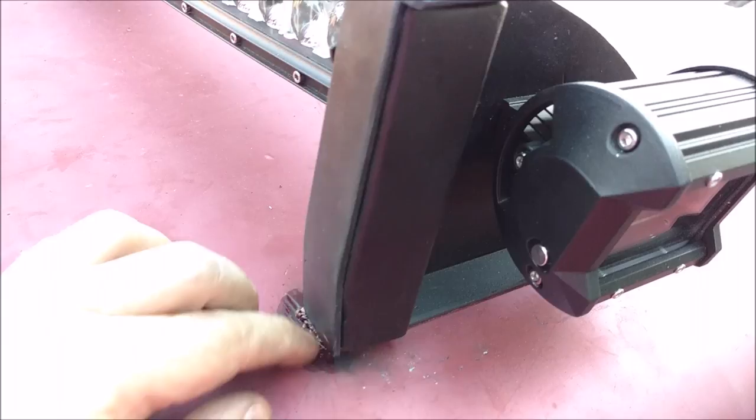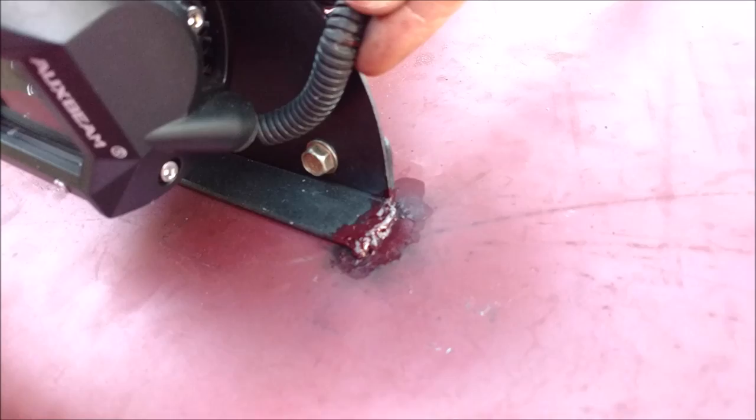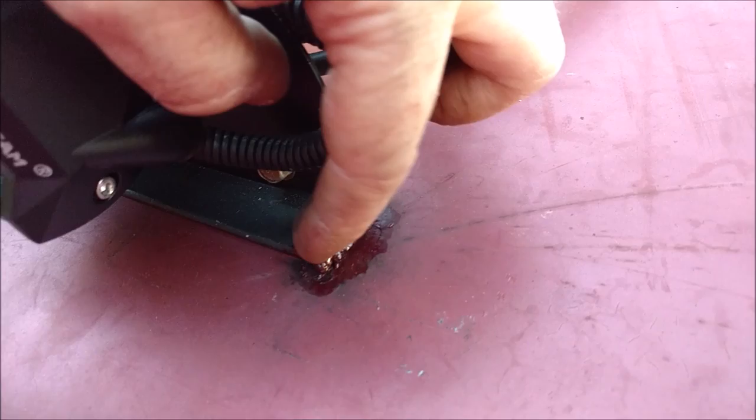And I just actually just roughly welded it to the roof. It wasn't the cleanest stuff. But again, it's not a show truck. It's a work truck. So it's just welded down to these brackets. That actually, it's just an L bracket that can actually be unbolted at any time. And you can just take everything off, and then just this L bracket stays on and can be cut off, but there's never going to be a leak because it's welded.